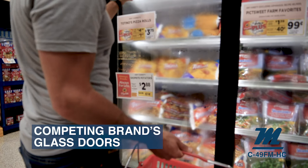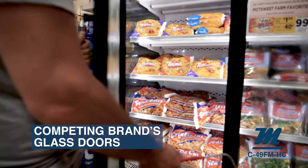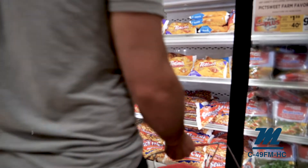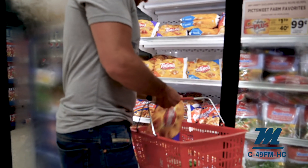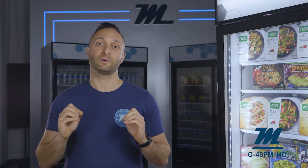Although keeping store ambient temperatures of 75 degrees Fahrenheit and with low relative humidity helps prevent condensation issues, having high quality glass doors is important in eliminating this problem. The glass door frames of our freezers and cabinet fascia are both heated, which will help prevent ice buildup on the doors.